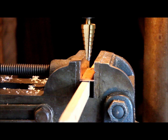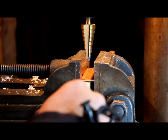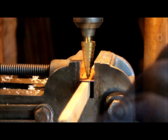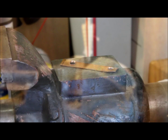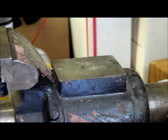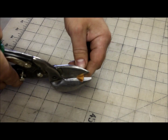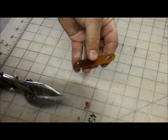One little trick you can do when you're drilling out a thin piece of plate like this is just slide a board under it in your vise. As you push down, the plate's not going to flip from side to side, and you can actually move the board back and forth a little bit if you need to. That's pretty close to the original size — we'll go test fit it and make sure it's going to work.